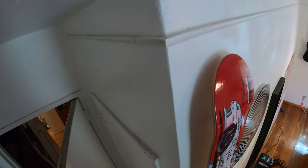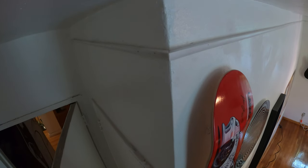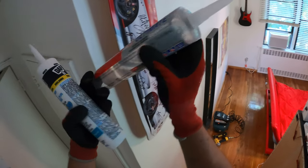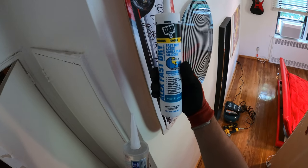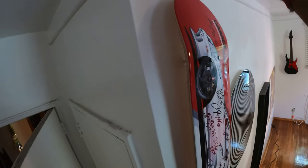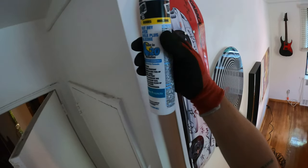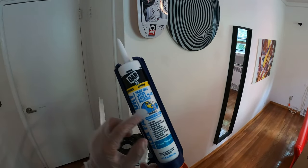Maybe I can shoot from underneath, but I think I'm going to glue it. For the other project I glued it entirely as we're going across beams. I have two products I could use. For the living room installation I used Loctite Power Grab Ultimate Crystal Clear, which I know for sure definitely works. Alternatively, I could use caulk silicone to seal the gaps. I chose to go with the white caulk slash silicone.